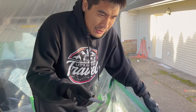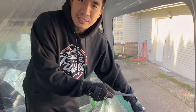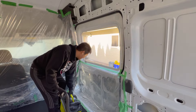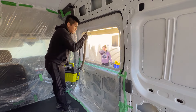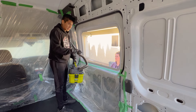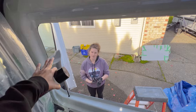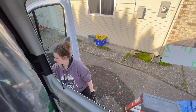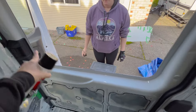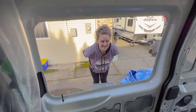Next we're just going to take this little metal file and file all the edges so they're a little bit cleaner before we paint them. One big rule we learned — when you're filing, you're supposed to just go in one direction; going back and forth is apparently not correct technique. Now we're just going to step back and clean up all around the edges, get rid of our metal shaving catchment, and give it a wipe down before the next step. Next we've got to prime and paint the edge of the cut we just made to prevent any rust in the future. We're going to use automotive primer first, let that dry, and then do a couple coats of Rust-Oleum white paint so we're triple-protected.